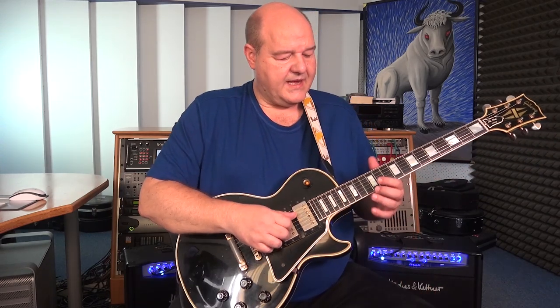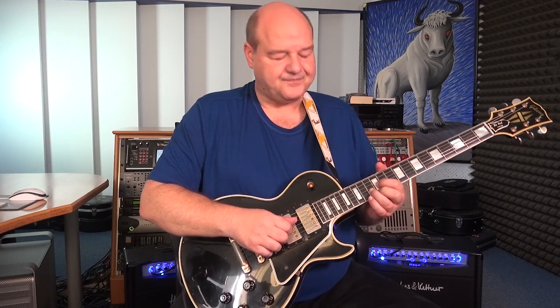And the principle, for those who don't know: what is a chorus? What is a chorus doing? A chorus processes the guitar signal and adds a second signal on top of it. And that's a delayed signal, but with a very, very short delay time. Most of the time it's between 5 and, let's say, 40 milliseconds at the maximum. And this delayed signal is modulated in pitch by an oscillation circuit. So the pitch goes up, the pitch goes down. And depending on the intensity of this modulation, your guitar sound starts to unfold a thickness, and also simply a wonderful effect.